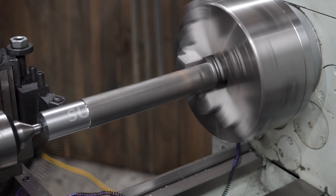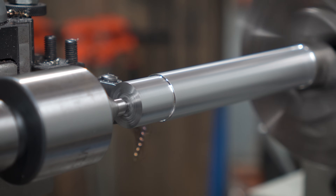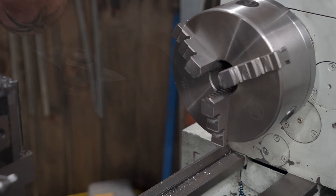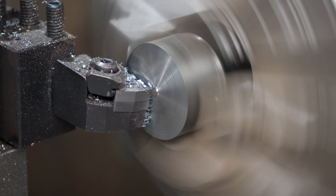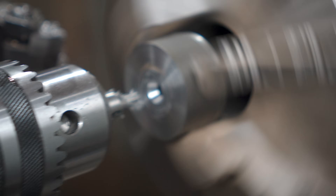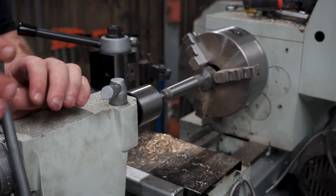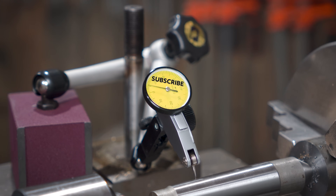All we'll need to do for this part is bring the whole length down to major diameter, then turn down a little area that will become a central shaft that will later be wrapped in brass and will ride down the centre of the tool. That should be close enough. So out comes the material and we can set it up for the morse taper. In goes a bit of scrap and it can get faced and centre drilled. Then I'll wedge a dead centre into that pilot hole with the live centre keeping it in check. Now all I need to do is dial this taper in using the old compound power feed. And that looks pretty good!